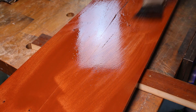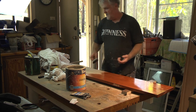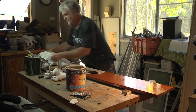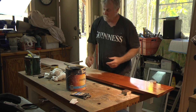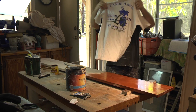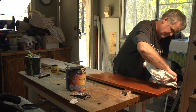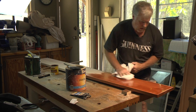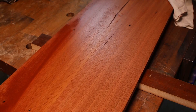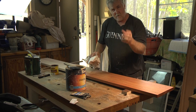You can see I'm just flooding this on there. It's not like paint — you don't have to worry about covering or anything like that. Normally I go by and I do the whole board and then wipe it down. I'll show you what I do. You take your clean rag, do your edges first. Don't worry too much about the bottom side yet — we're going to turn this over. You always want to wipe in the direction of the grain and have a consistent pressure. Don't press harder in one spot trying to rub something out — you're going to rub more stain out.